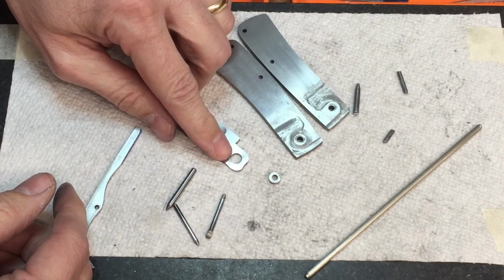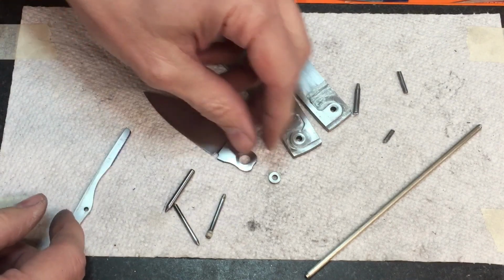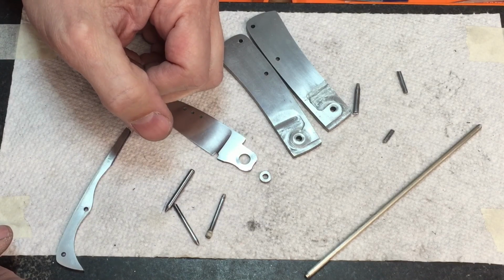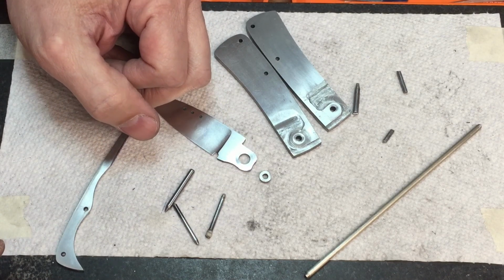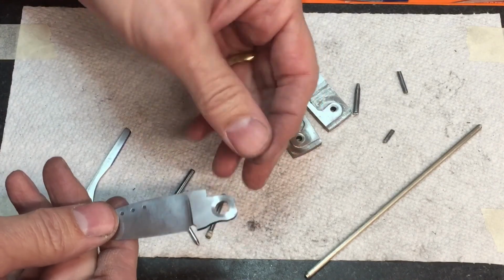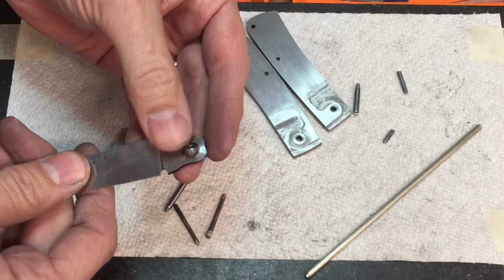Okay, so drill, if you have to, drill a hole slightly smaller and get a precision reamer. I use that sometimes. Honestly, I don't use it all the time. A lot of times, if I'm doing an 1/8 inch hole, I just go with a really good high quality 1/8 inch drill bit, one that's not worn out, one that's not going to be messing the hole up. If I start finding holes are getting sloppy, I might go to a new bit. But that's one thing that'll help.